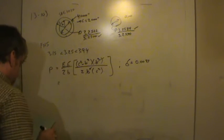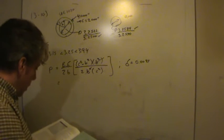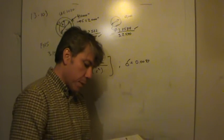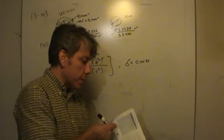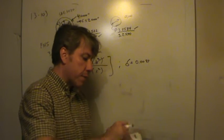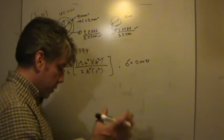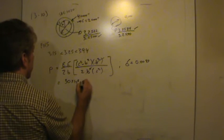All right, so we need the elastic modulus of 1020. It's just steel, so let's see if they have anything a little more accurate. Steel's elastic modulus is something you should commit to memory, and that's 30 E6 psi. I'm looking in the book to see if they have elastic moduli for various materials, because it does vary a little bit, but not a whole lot. And I don't see it in here. It may be somewhere else in the book, but for the sake of this chapter and for what we're doing, using an elastic modulus of 30 times 10 to the 6th psi is fine.